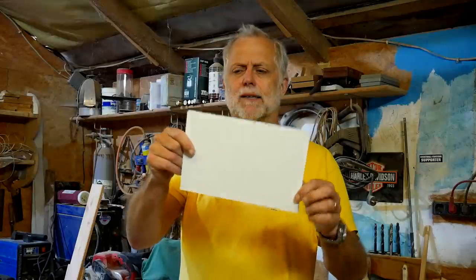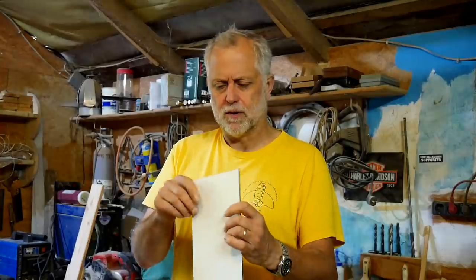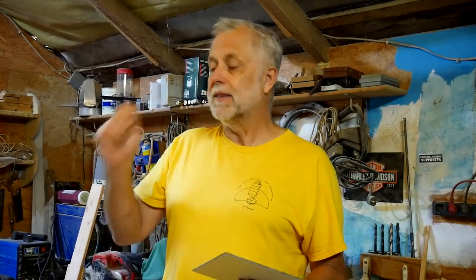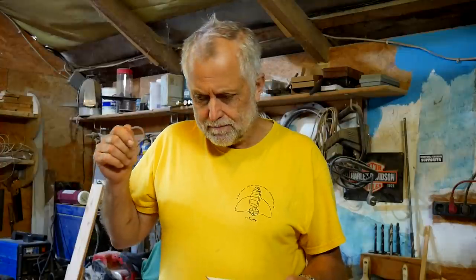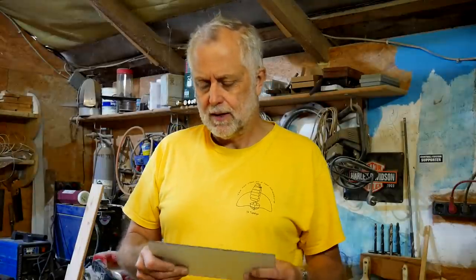This material here, it's a pressed laminate. I think it's one of those things where it's paper and epoxy resin basically pressed together. Good solid material. Quite difficult to cut. First challenge was to cut it cleanly. And I tried the little Bosch hand saw, I tried grinders. In the end, I cut it on the table saw with the blade wound well down, and by putting a piece of ply underneath it to support it, ran it through the table saw, and it came out with a fairly clean cut then. That was the first challenge.